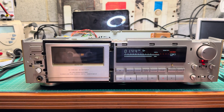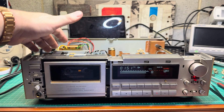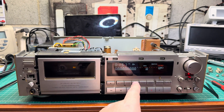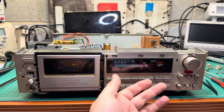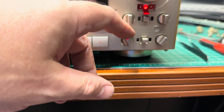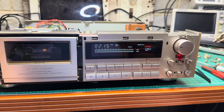The deck works. This flickering doesn't affect any audio or logic. The main CPU and tape transport - everything works together, including the audio part. Only the indicator part is affected. There is a separate CPU for the indicator with just three capacitors. And this is a red LED working through this optical light-conductive part.